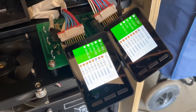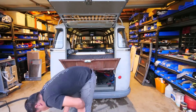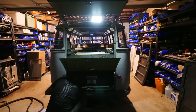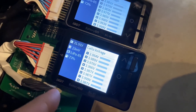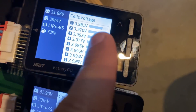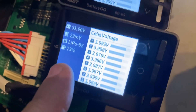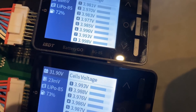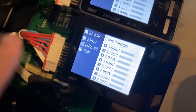It's been about 10 hours now, and as you can see they're all evenly matched — there's about 29 millivolts and 23 millivolts difference. I'd say this is doing a pretty good job at balancing. From here you can connect this pack to the rest of them and charge them all together.